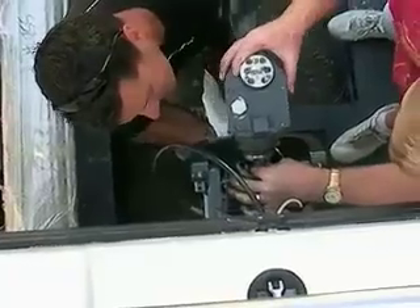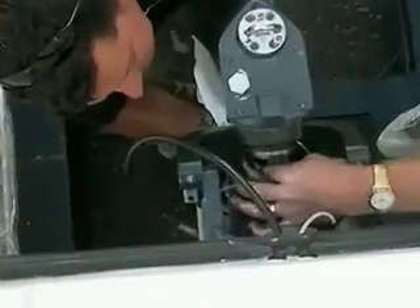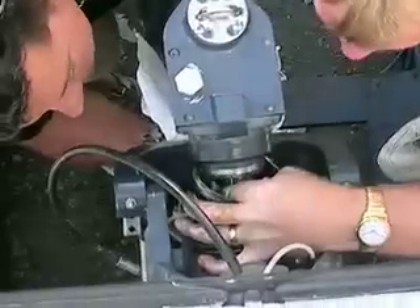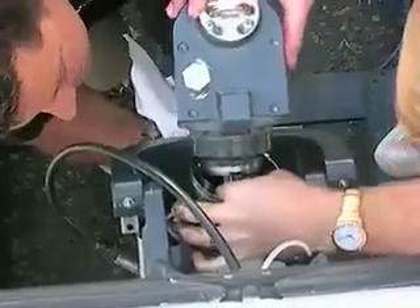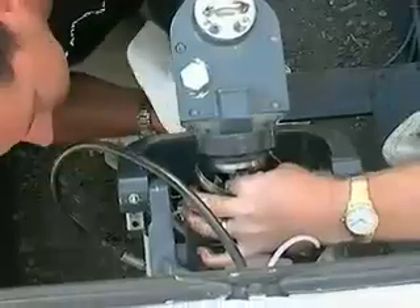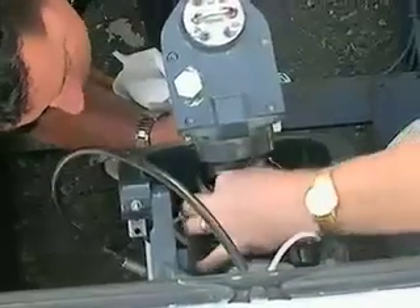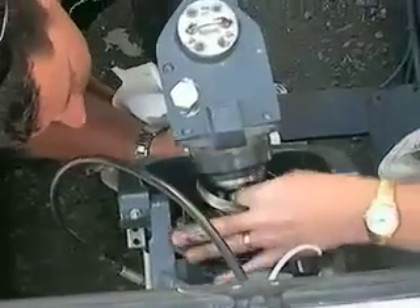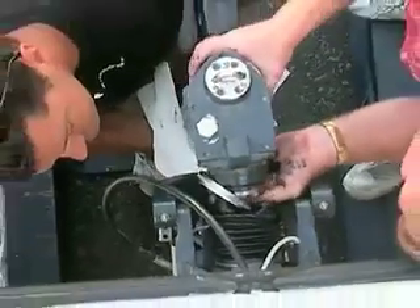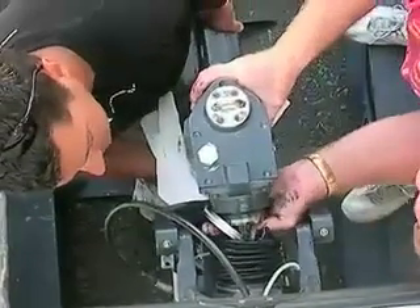You are now ready to install the newly repaired drive leg. You may have a little struggle aligning the spline with the leg, so take your time. It may help to turn the propeller a little bit to align the spline. Test that the spline is positioned correctly by turning the spline to see that the propeller turns. The retaining pins on both sides of the yoke should be inserted with the cutout facing aft. If necessary, realign the pins and reinstall the set bolts.